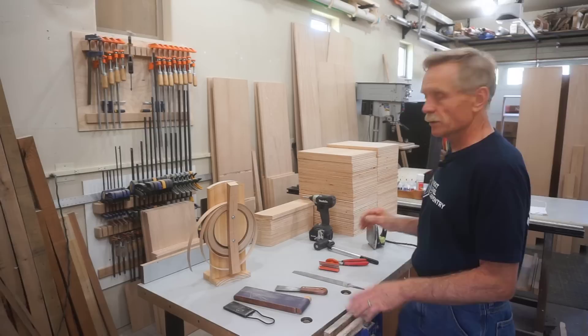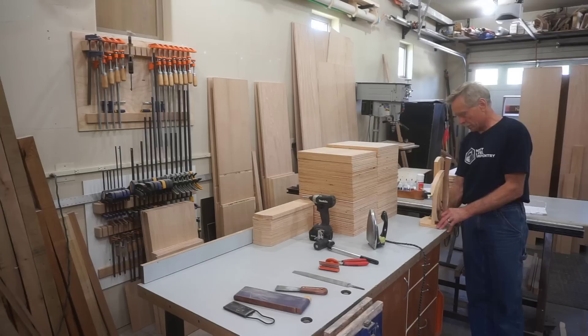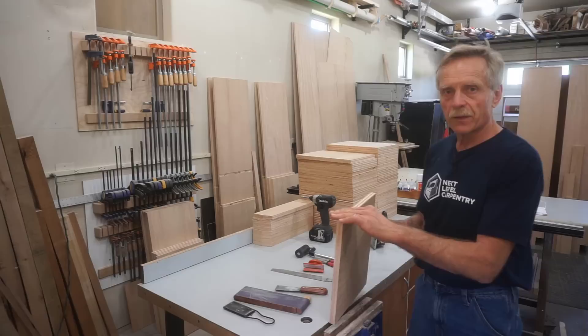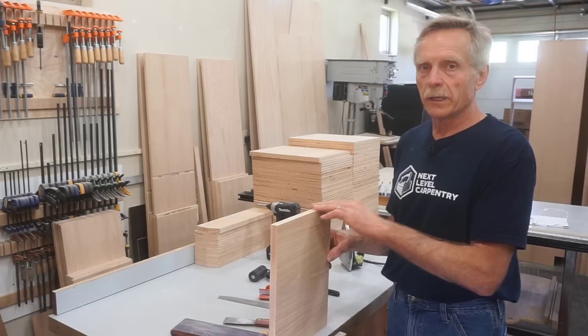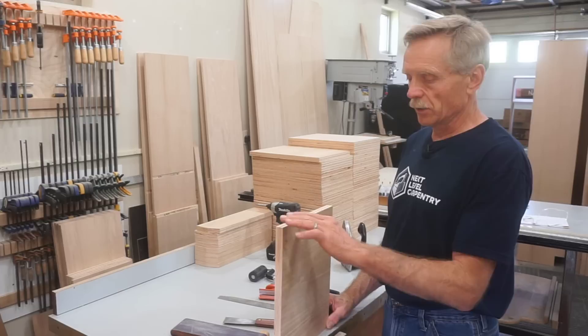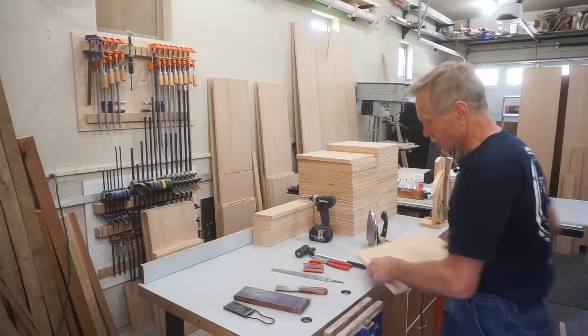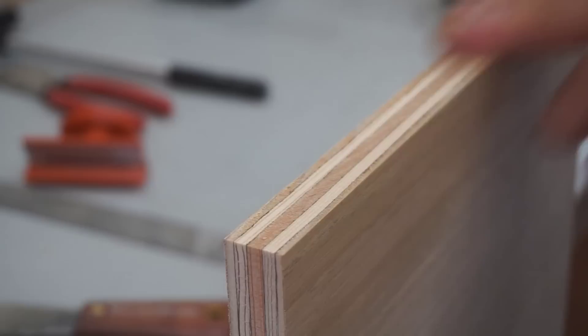So I'm going to go ahead and do a couple of these shelves. I'll move my little edge banding dispenser over here. The first thing I'll mention is that to get good results, you have to have good cuts. If your blade has wane in it or your rip fence isn't lined up and you get saw marks in the wood, they'll just telegraph through the edge banding tape. If they're any more than a thirty-second of an inch, they'll show through the edge banding. So step one in quick professional edge banding is smooth edges. I like to work in a vertical orientation rather than clamping something down and doing it on the side — I've got this handy vise here that takes care of that.